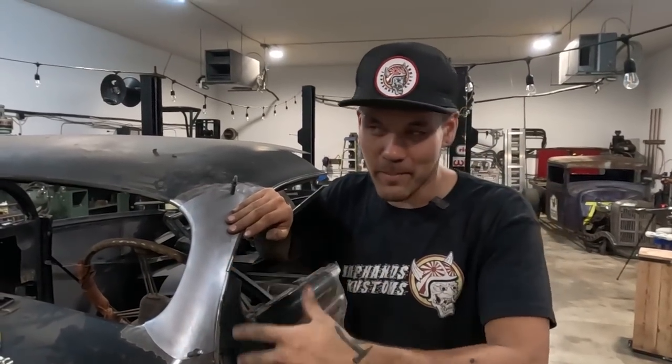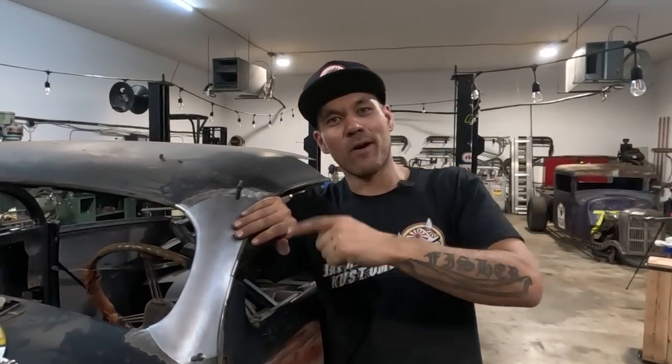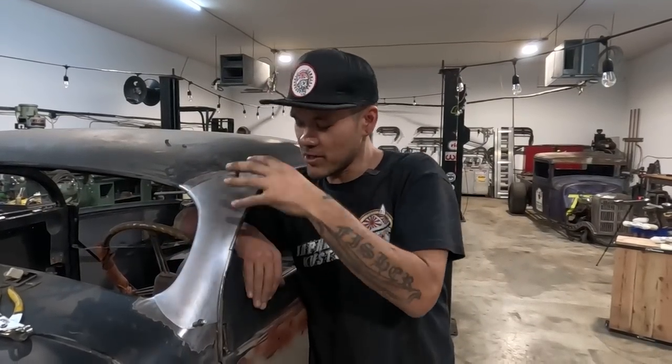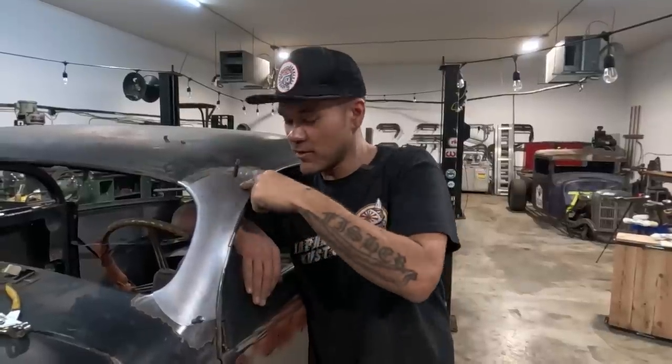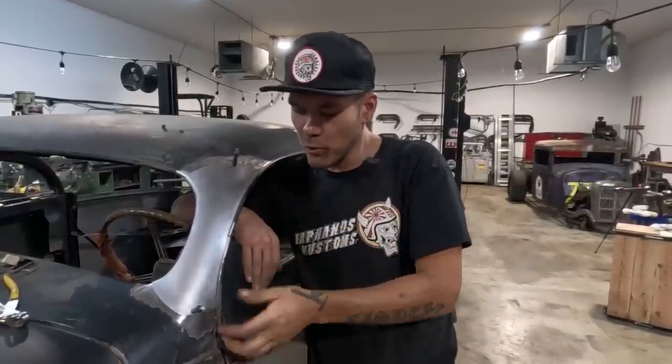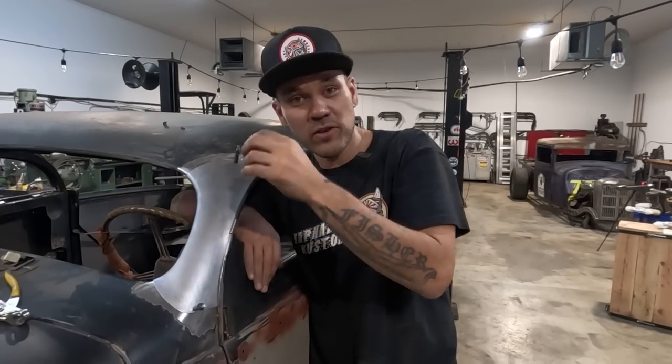We're gonna make the other side, but Elio's great idea: why don't we try and make the other side with all the tools? So we did hand tools on this one. This one, I'm gonna use a bead roller to roll this edge. We're gonna use a power hammer to stretch the crown into this area. We're gonna use the English wheel to roll. We're going to stretch this edge, perhaps with the English wheel. We'll still use the kick shrinkers as well, but I just wanna show you guys that you can do this